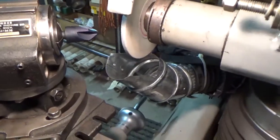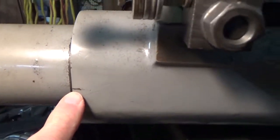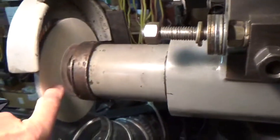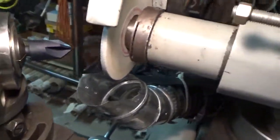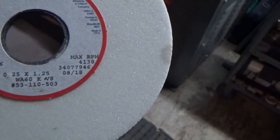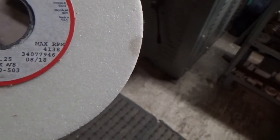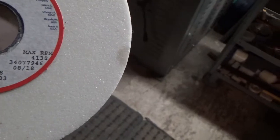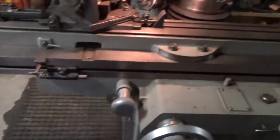The center line mark for the spindle on the tool and cutter grinder is on the same center line as the fixture. I've got a fairly narrow wheel on it — this is a Radiac wheel, six-inch diameter, quarter-inch wide, inch-and-a-quarter hole, and it's a WA60K Victor 8 wheel. Max RPM is 4138. I've been buying these wheels from Travers Tool Company down in South Carolina, and they're a fine bunch of folks to do business with.